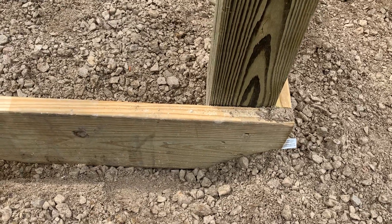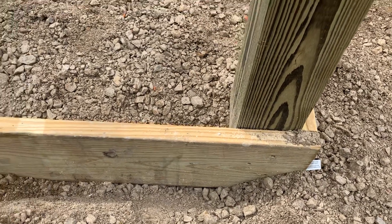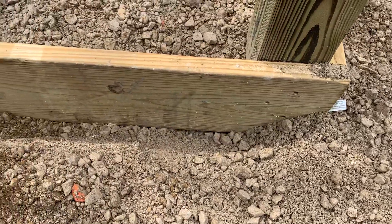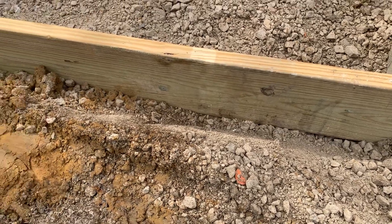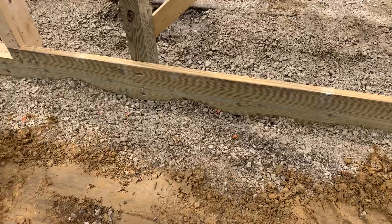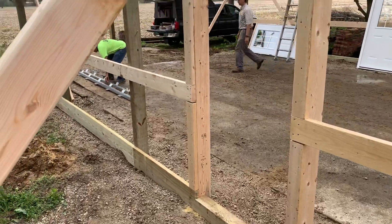That stone right there is a 411 perm berm mix. We don't backfill it with regular stone — we backfill it with that berm mix. It's kind of like a highway stone, very sandy, and the water can dissipate. You can see right there a two by ten baseboard — again that's ground contact, that's a number one treated board. We want to keep away from termite rot and the elements of rain as well. So a ground contact number one treated.